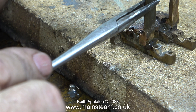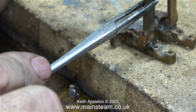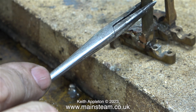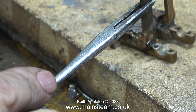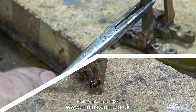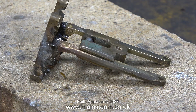I'm holding this part using a pair of surgical forceps. The original part doesn't fit perfectly — it's broken and bent and has been like that for a long time. I straightened it out the best I could by tapping it with a hammer. As I solder this part I carefully hold it in position using the forceps, making sure it's perfectly in line with the other one. My method seems to have worked because the crosshead slides up and down the guides without any friction — though there shouldn't be much friction as it's a rattle fit.